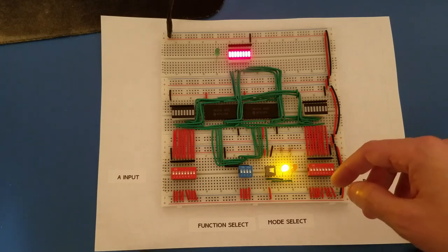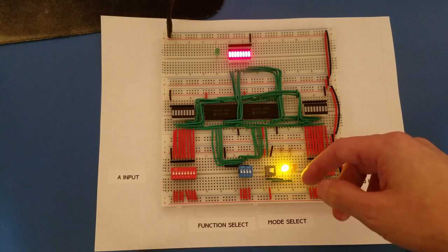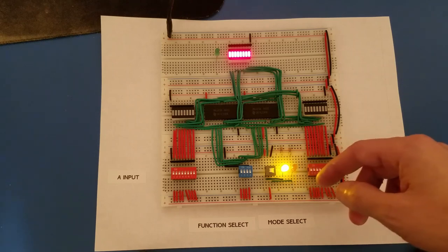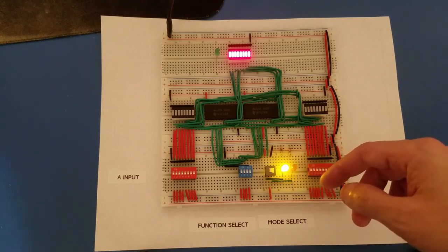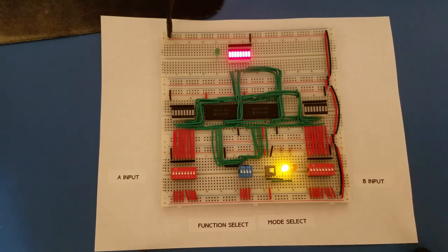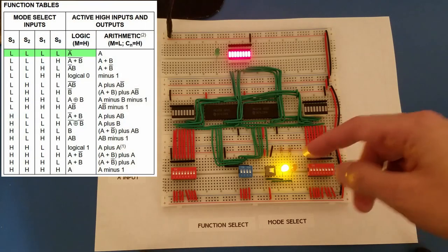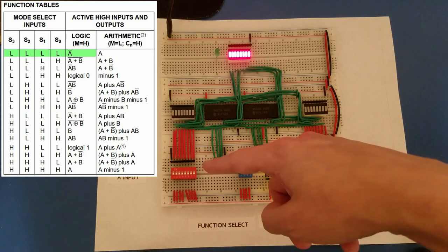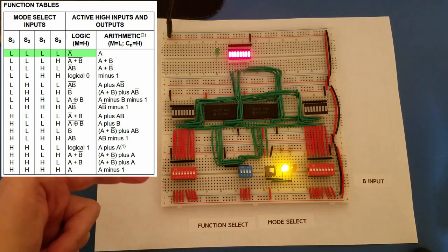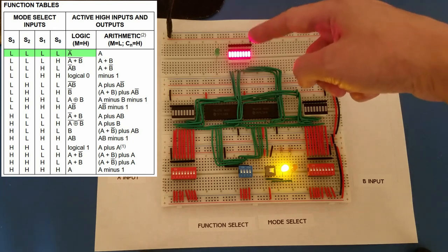But quickly, currently I'm in logic. I have the mode select set to logic, and if you look at the data sheet, I'll put a link to it in the description down below. The first logical operation that we have is just not A. So currently all my A bits are toggled off. Because all of my A bits are toggled off, all of my outputs are on.